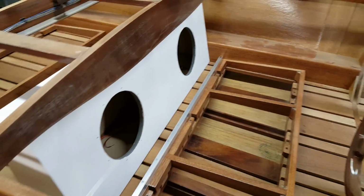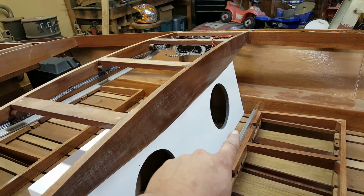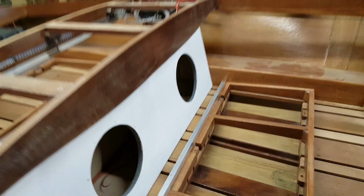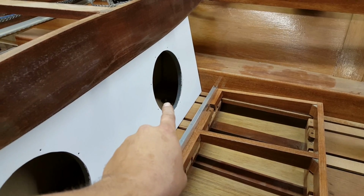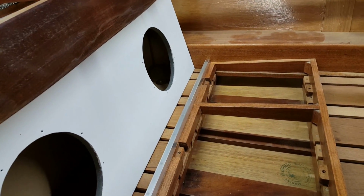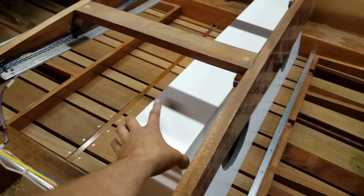Alright, so we've got the box mounted in there now. We've got the T-nuts installed in this wide plank and the wide plank over here. Got the floor planks installed back in the boat. It'll be hard to see, but you can see there's a 3/8 by 2-inch stainless bolt with a 3/8 stainless washer on top of two stainless 2-inch diameter fender washers. So there's a better look at it. So that's how it's bolted down to the bottom of the boat, and it is rock solid.